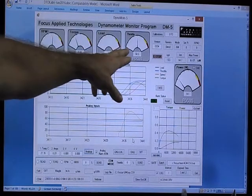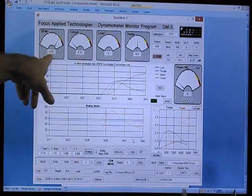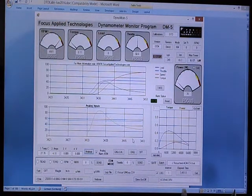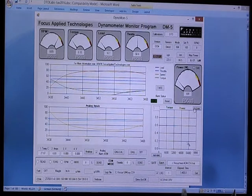Okay, we're at about 50% of our power, and we can see it's operating at relatively high speed, about 6,000 RPM, which is the rated speed of the motor. We'll clear this graph so that we can see it clearly. I'm now going to increase slowly the manual load going to the coils, which will load the motor, decreasing the speed and increasing the torque. And you can hear it slowing down. What's happening is it's now tracing out the motor's torque curve.